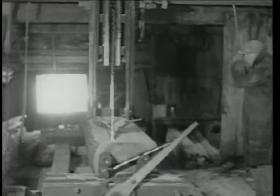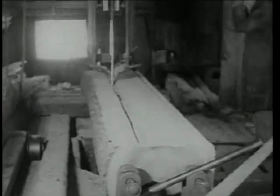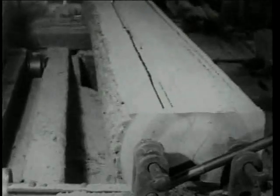The chain Mr. Kirkwood is pulling gigs back, or reverses the carriage, when the length of the log has been cut in order to remove the saw from the timber. Since the log is not sawn all the way through, what remains at the end is called a stub shot. This must be removed by hand once all the boards have been cut.